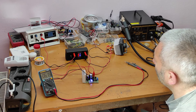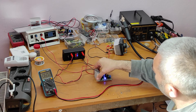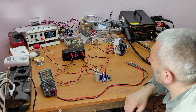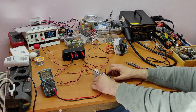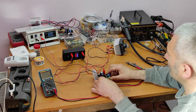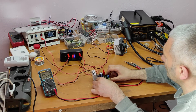With a smaller voltage there is also fluctuation — we only have fluctuation here, not there. Now the diodes are cold because they are not working. Also, what I don't like is that this potentiometer should go from 0 to maximum voltage, but at the minimum position we still have 5 volts on the output. I'm a little disappointed by this stabilizer IC.